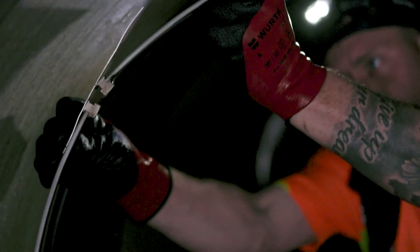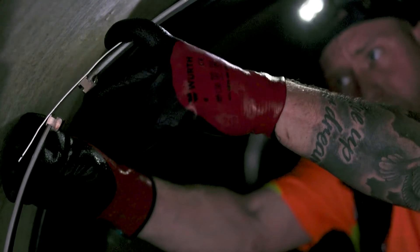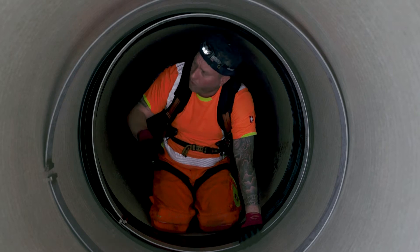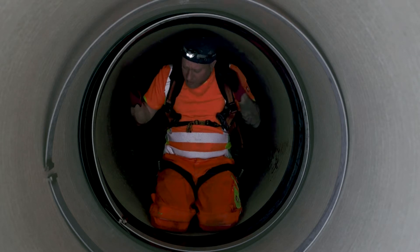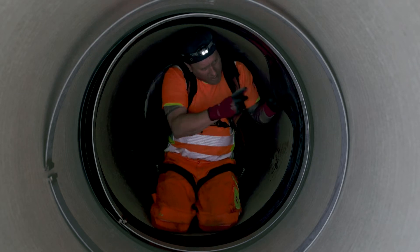As you can see there's a little point load here — it's slightly raised. To cover that, we put on the shim, which then allows this to slide open under mechanical force but also stops point loading into the EPDM. With this ring in place — very important at this stage — the ring will hold the rubber up, so it lets your hands be free to move around.